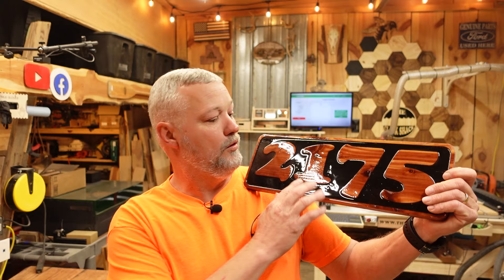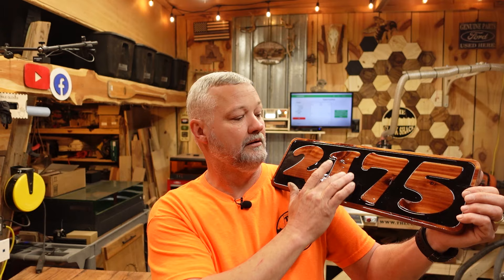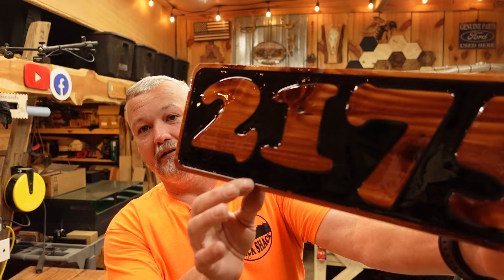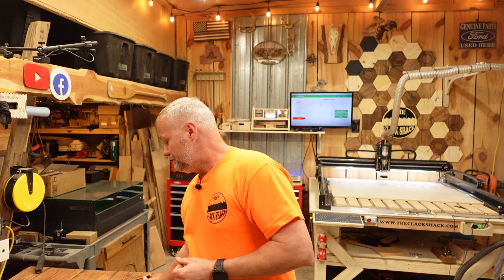Another project I did for our house - my wife's redoing our back deck and fixing up the yard, so I said it needs a little more Clack Shack swag. I did our house numbers in an old piece of cedar. I CNC'd the cedar, painted it with black spray paint, ran it through the planer once to expose the wood underneath, then painted epoxy over the top to try to seal in the natural cedar color, hoping the sun won't fade it as quickly.